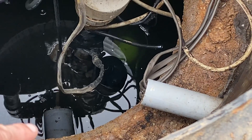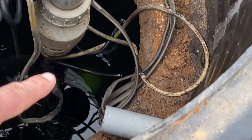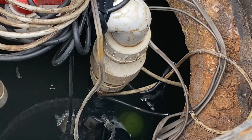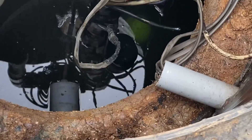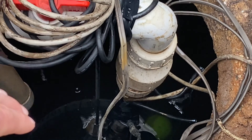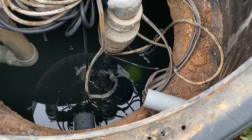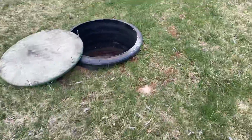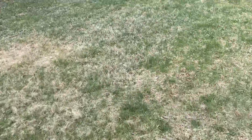On the bottom we're going to see our pump. We're going to have our on/off float, high water alarm float, and emergency off float. That green float is designed so that for whatever reason the on/off float fails, rather than having the pump continually suck air and burn up, when that float faces down the pump will disengage. The gray float is what will traditionally turn it on and turn it off — when the float's up it'll turn on, when the float's down it'll turn off, just like you would see with a sump pump. That black float is specifically designed so that if for whatever reason the water in the chamber gets too high, there's an alarm in the basement that'll go off and tell you there's a problem in the pump chamber.